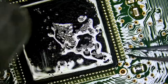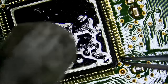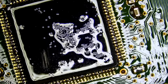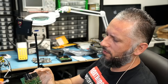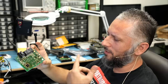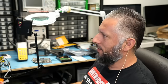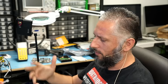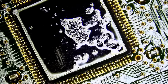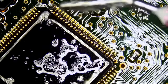And to be honest, I'm kind of nervous applying hot air to that board. I mean, that coat is changing colors right as we speak. I applied just a tiny bit of hot air, and look at this. You now see a brown spot. I only applied a tiny bit of hot air. So I do not think that I'm gonna go that route, and I already smell the smoke, that weird smell. The coat is melting down, and it's the same smell that happened when I worked on a similar board where everything just suddenly smoked. I'm not gonna apply hot air. We're gonna have to do it the safe way and the healthy way, the organic way. Let me turn my fume extractor on and let's go the low melt solder way.